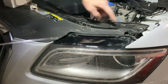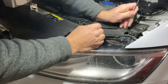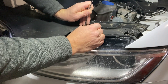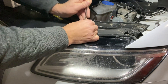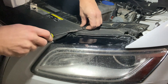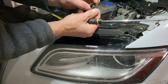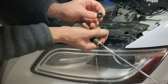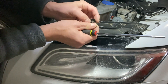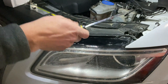Just a hint - you have to remove those two pins. Use a flat screwdriver and just slightly press the little knob in the middle. It goes very easy, so be gentle. If not, it will pop to the other side and you'll lose it. Just pry it - if you press too hard, that little pin will literally go to the other side. You can take them apart to reassemble - I'll show you, but it's pretty easy.